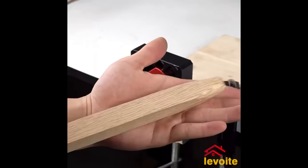The Marshalltown Stair Step Scribe is an indispensable tool for marking, measuring, and cutting laminate or LVP flooring to fit any stair. Made of durable, non-marking plastic, it spans from 28.5 to 48 inches, excelling in tight spaces and around trim. Set on the stair, adjust the knobs, and mark the cut line. Besides measuring, it maintains uniform risers. With its efficiency, those installing hard surface flooring on stairs will find their work faster and simpler, making this scribe a must-have.